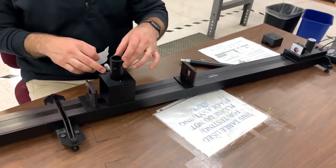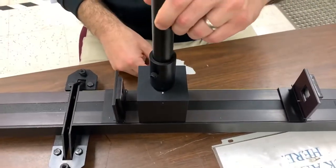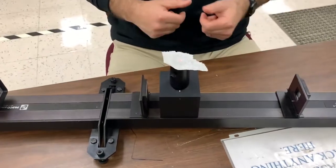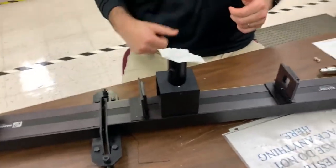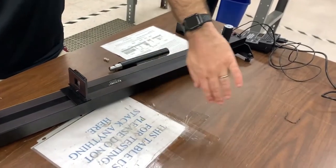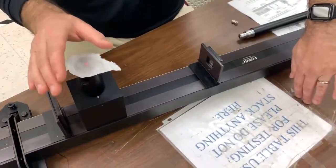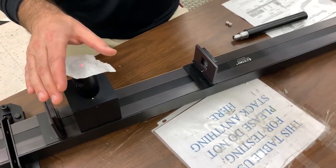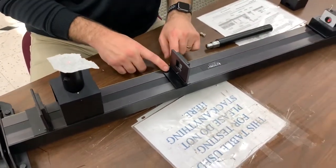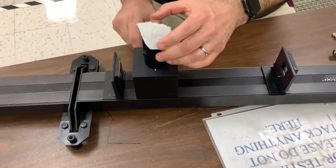With this beam splitter on the microscope housing set to 45 degrees, if you put a piece of tissue over the opening here — and this eyepiece comes assembled like this, you can loosen the black thumb screw and this piece comes out to help with alignment — you put a piece of tissue over the top and you can see the beam coming up through the microscope housing. If you block the beam between the two mirrors, this spot disappears and reappears when you do that. You can adjust this lens's position slightly forward or backward and it will sharpen or make smaller that spot in the housing.